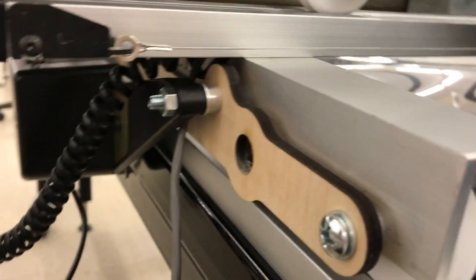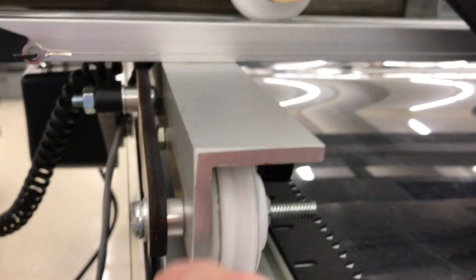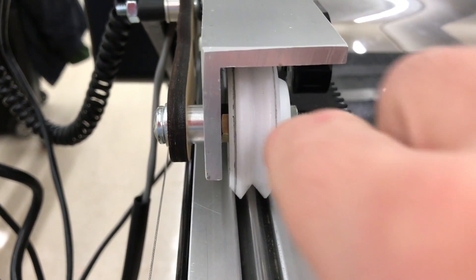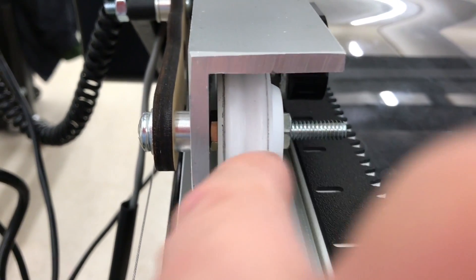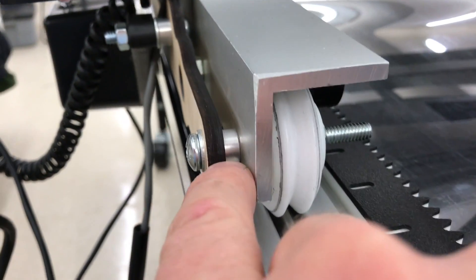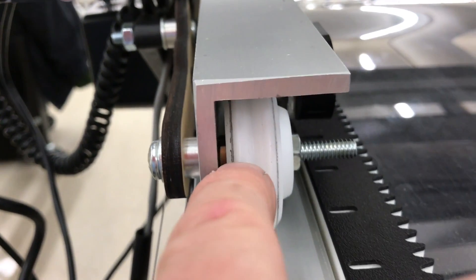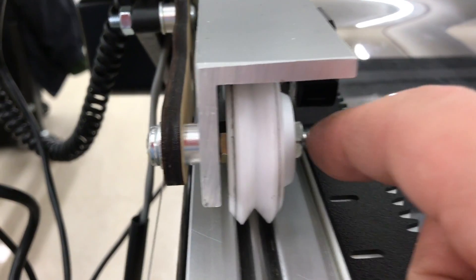The next thing is to install the rear or X-axis drive bracket. Remove the original bolts that hold the wheels on — there will be a nut to remove from the original bolt, and then another nut inside. Once the outer nut is off, take the wheel off, loosen that inner nut, and take the bolt out. Replace it with a 1/4-20 by 2.5-inch long screw: the screw goes in with a washer, through the wood piece, then a 1/4-inch spacer, through the hole in the aluminum angle bracket. Tighten using the original nut, then put the wheel back on and replace the outer nut and tighten just as it was originally.